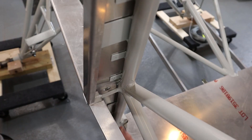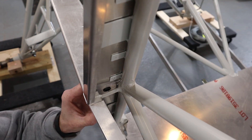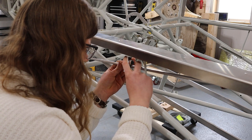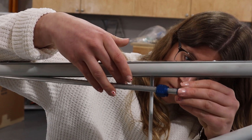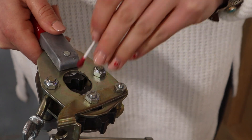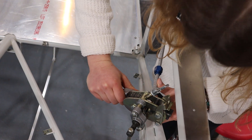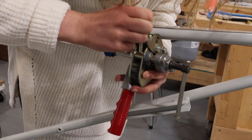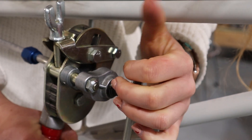In most places where we penetrated formers, we used plastic snap bushings. When using these bushings, you need to make the flares after the fuel line is in place. The flaring process: cut the line to length and deburr it, slide on the nut and sleeve (and in some cases heat shrink), then put a dab of oil on the head of the flaring tool, slide it on until you hit the depth gauge, clamp the tool down, and tighten the head to create the flare.